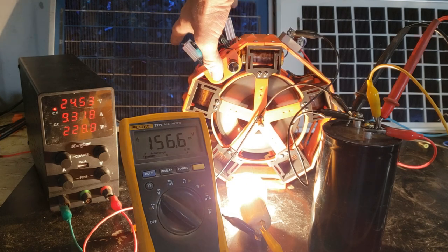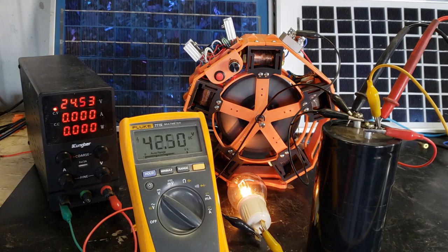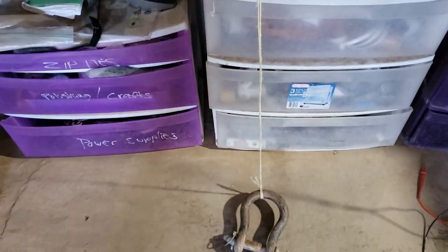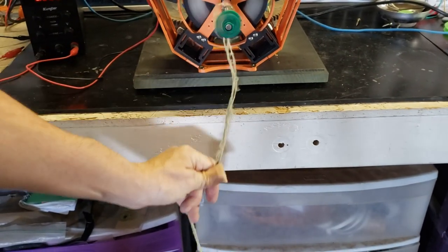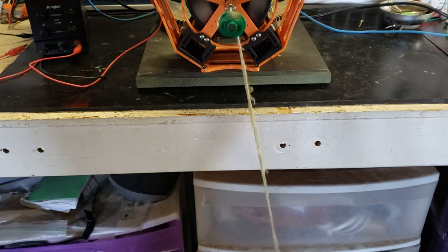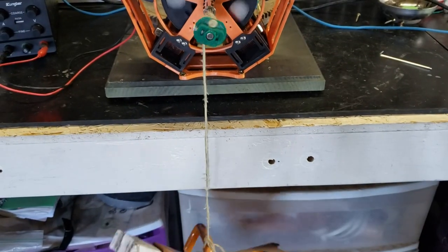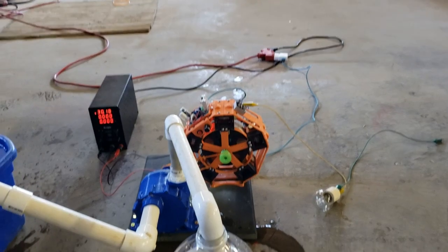Keep in mind I have these generator coils wired in series. If I rewired them in parallel, the voltage would be half — which I could live with — but my current would double. The added torque lifts this shackle with ease. Refer to my previous video for weight measurements.